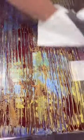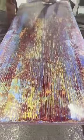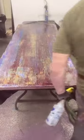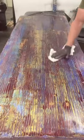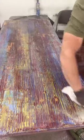So that is what we're trying to polish, this wall epoxy that we did this kind of petrified wood grain pattern on, until we get that shine. But I want it to be a natural shine, not from pouring something over it, not from spraying it. I want to polish that shine right out of it. You could do this on a backsplash, in a shower, an accent wall, just about anywhere.